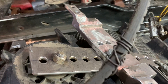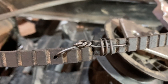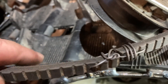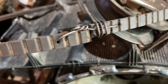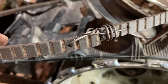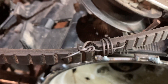When I said it wasn't the proper belt, I just took an old belt, cut it, and shortened it. If you're ever stuck out in the middle of nowhere with a broken fan belt, poke a hole on either side of the break, stick a chunk of baling wire through it — and if you don't pack baling wire in your vehicle like I do, look for a piece of fence to steal some wire from — and wire your belt back together. It should get you back to town and away from the banjo music. On that note, we're going to leave this video here for today. Remember: use what you got to make what you want.